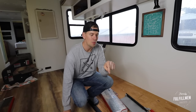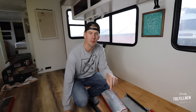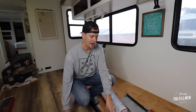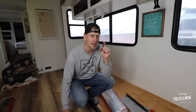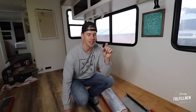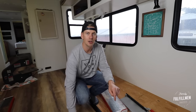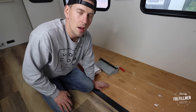Number three: learn from my mistakes. When you put your floor underneath the slide, that is where you should start your project. I started back in the bedroom and worked my way forward, and when I got to the slide portion I had this tiny little piece — only about an inch and a half thick — and it was next to impossible to get it under the slide to line up. What I should have done is started with the very first piece underneath the slide and worked my way out from there. If you haven't started your project yet, please start there.